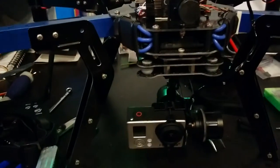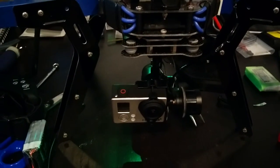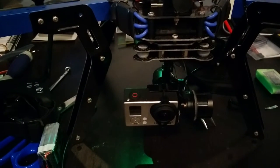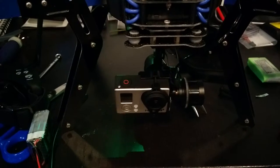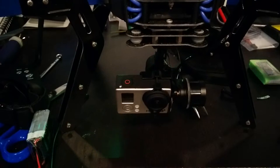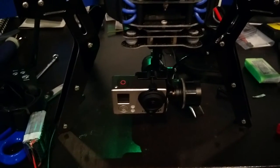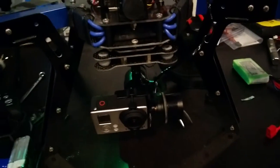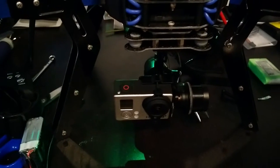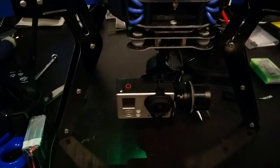I've got it configured right now to the best of my ability. The BaseCam controller that comes with the DYS gimbal has firmware 2.3b5, which has an unfortunate bug. You cannot set the yaw min angle for the RC control, which means it is always its default of negative 45. You can set the positive max angle, but if you do that, the camera will be skewed because it would go farther in one direction than the other.